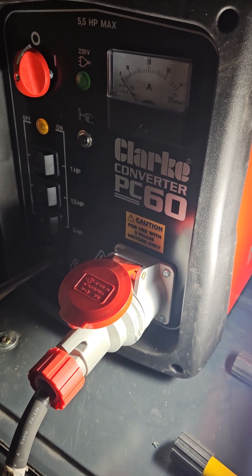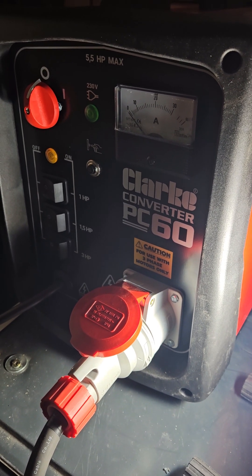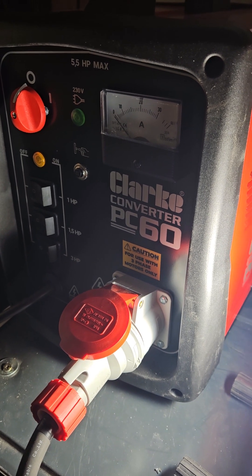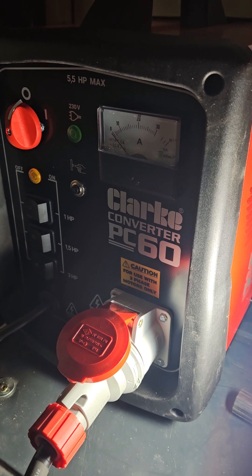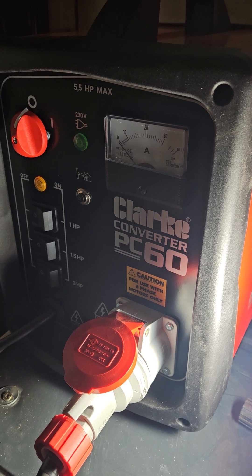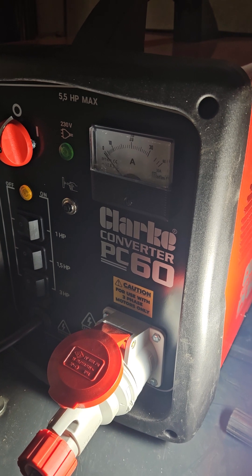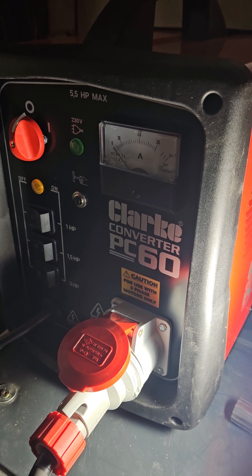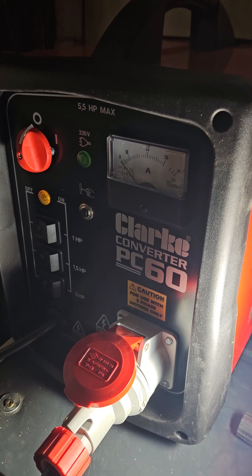That's a problem. So I looked into my machine, opened up the box, had a quick look and went — it's got a neutral earth in it, blue wire. I thought this won't work, and left it for a couple of days planning to send it back. Then I decided to open my motor up and have a look inside. I opened up the motor and, sure enough, the neutral blue wire was capped off with no power to it.